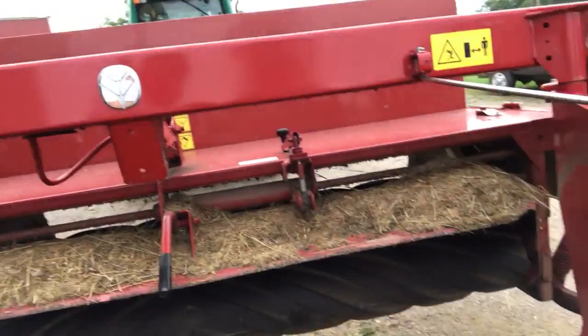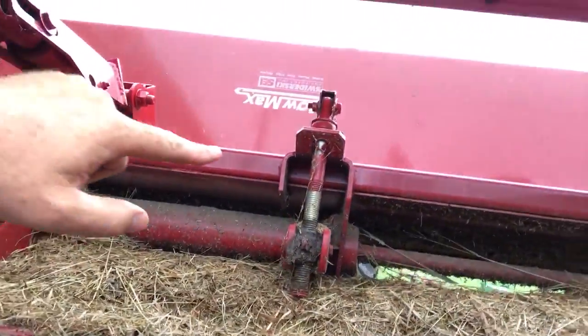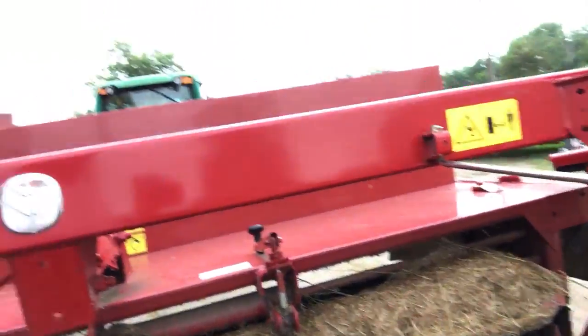Okay, now the tensioning of the rubber-on-rubber Chevron rolls. This is for crimping your product, which is going to be heavily needed for the sorghum to help with some dry time. This is the adjustment right here for the tensioning of these rolls. Right now, I have this adjustment, and I'm going to leave it on what it's needed to do dry hay. Obviously, hay is not even close to what that sorghum is as far as the beef of it and how much the quantity that's out there. I have it right now to where the rolls, there's no tension. It's the perfect happy medium.